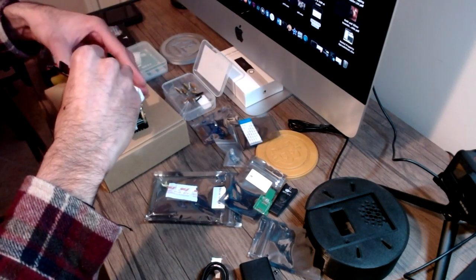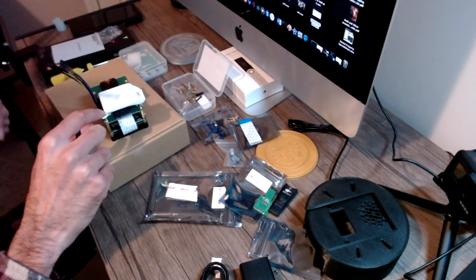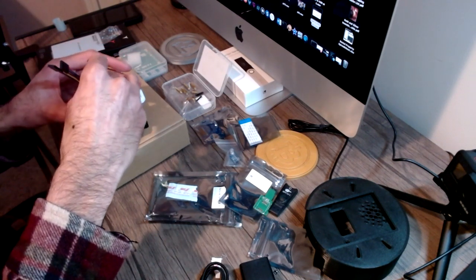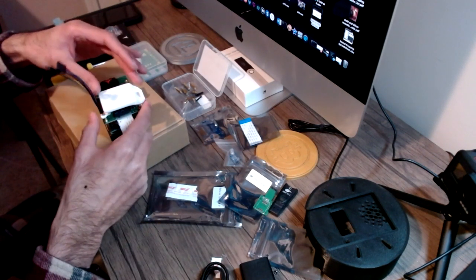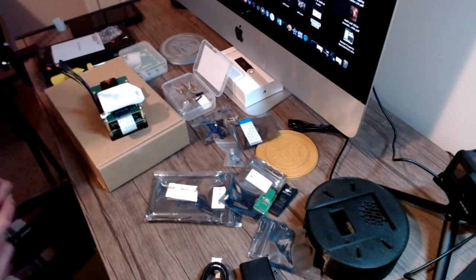So yeah, there you go, guys. Just a quick tip. As far as fiddling around with these small screws, it might be easier to put the screw inside of the diffuser first and put that on top of where you're screwing it. Okay, so now that we've got that, let's take a look at the next step.